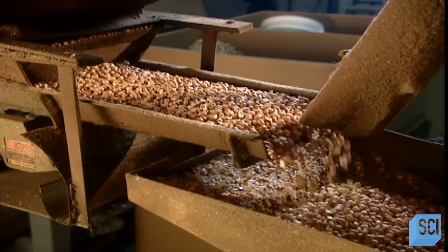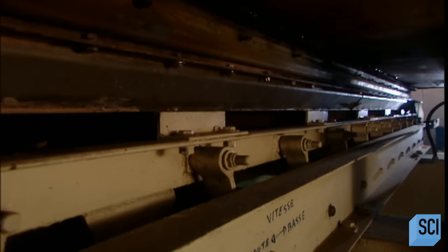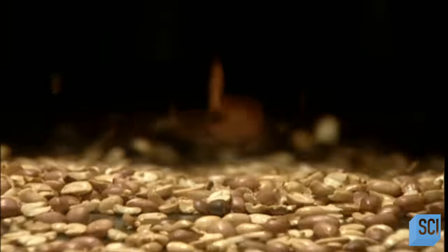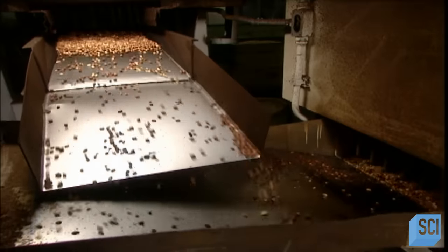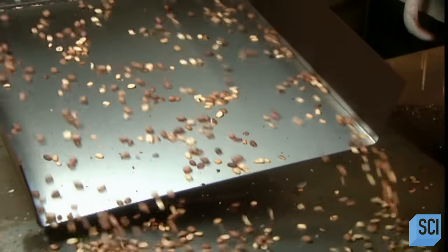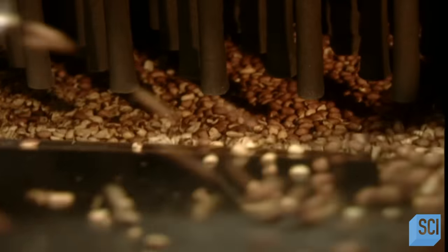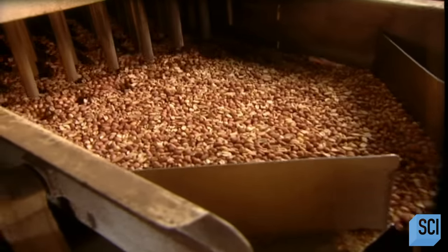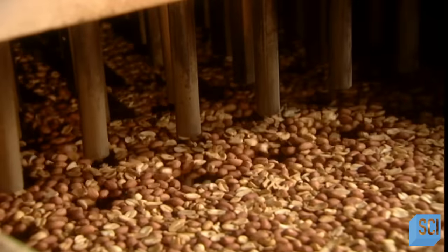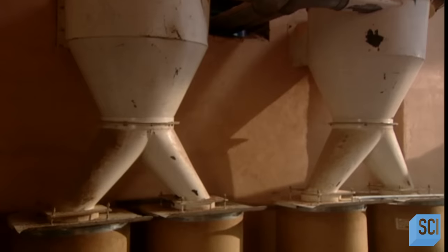The first step is to roast them. The nuts travel through a hot-air roaster heated to 399 degrees Fahrenheit. The shaking motion moves them around so they roast evenly. Almost four tons of peanuts go through this roaster per hour. When they come out, they turn from white to light brown. Next, they go into another machine that fast-cools them at room temperature using suction fans that circulate air quickly. This rapid cooling process is critical — it halts the cooking and prevents the peanuts from losing too much oil.